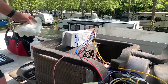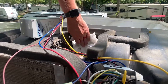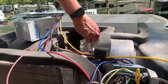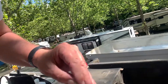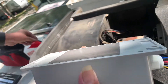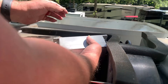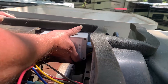Before we start this up we need the mount. I'll start to the side wall — make sure it doesn't hit any cables or anything like that. Peel off the VHB tape backing, put the super sticky side down, slide the cables in there so I want the cable down. If water gets in here it's going to run down and off the cables, not down the cables inside the unit.